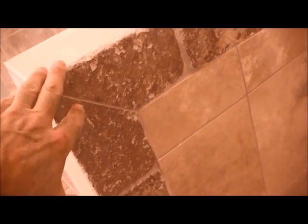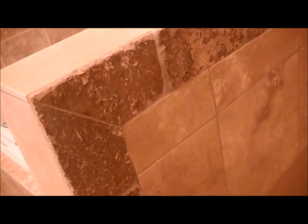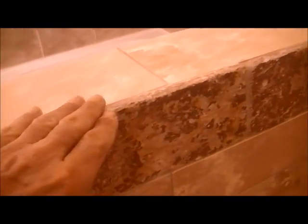Although I don't like to match up tile from different families, I did take some pains to match up the front of the curb tile with the current floor tile. That grout is still wet but it'll dry the same color, so it kind of looks intentional. I had the customer buy 24x24 inch tiles — since the space is 40 inches across, that's 20 and 20 — so there's just one grout line on the curb and as few grout lines as possible. That always matters.